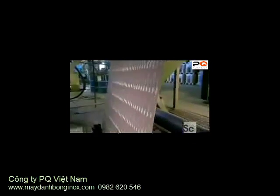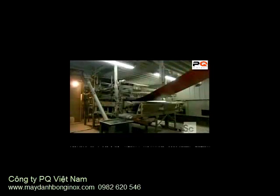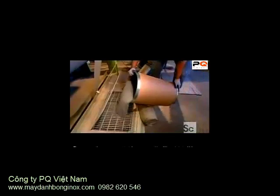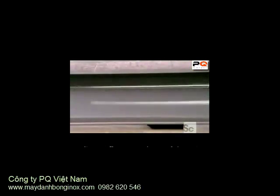Then, the cloth is pulled one floor down to the electrostatic pit. Here, the environment is kept hot and humid, perfect for applying abrasive grains to the cloth electrostatically. The grains are poured onto a conveyor belt in the pit. The conveyor moves the grains under the rolling cloth and between electrodes and ground plates. The system generates an electrical field that triggers a mini sandstorm.